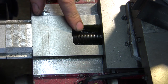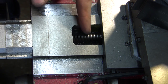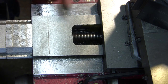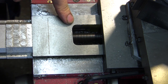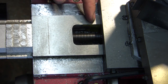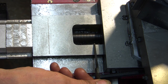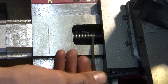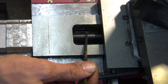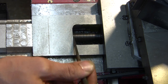So we're looking at the lead screw here on the cross slide. This line here that I've scored is so I can know when the lead screw is at the end of the nut, or it's about to start disengaging from the nut. Basically what I've done here — originally this casting ran to here, so that was solid cast there. I've milled out a pocket here, so this lets the nut — rather than the nut hitting here, it can move all the way back before it hits up here.